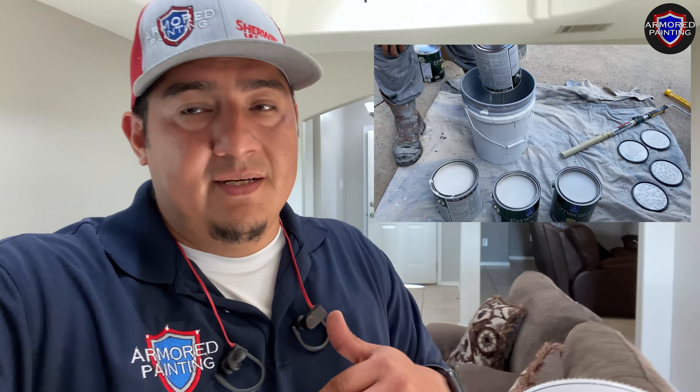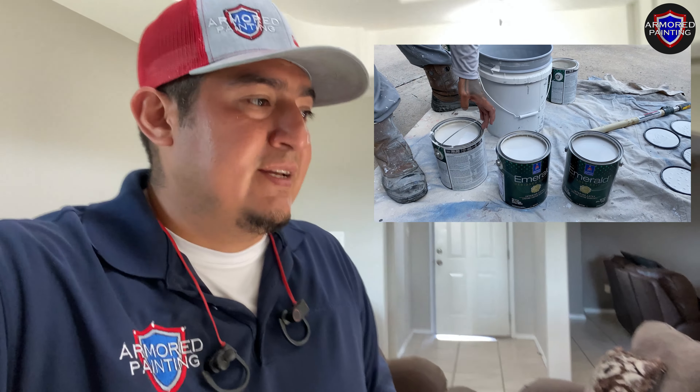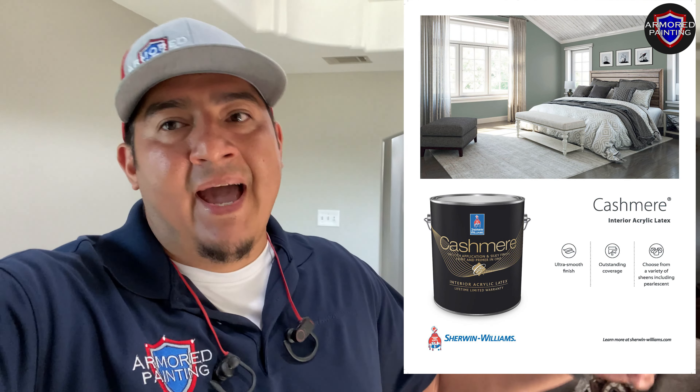Part of my job and my company is to educate the customer and homeowner on what paints we have to offer, what products we handle, and what I recommend for your house. I'm going to ask you a lot of questions to find out what you need, because you may not need the most expensive product — there are average or medium grade products that might work for you. In this particular house we went with the top of the line, the best — Emerald Designer Edition — just because of its extreme washability. But if you're just a couple with no kids and no pets, you might want something elegant with a matte or flat finish and not be as concerned about washability.